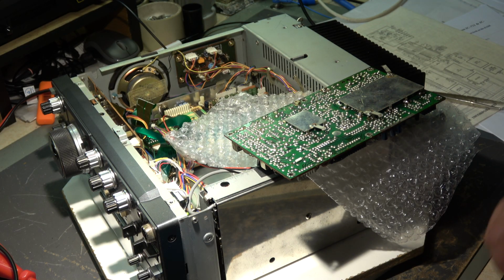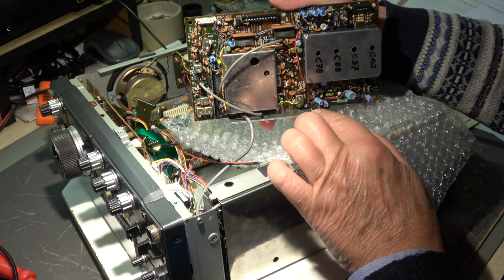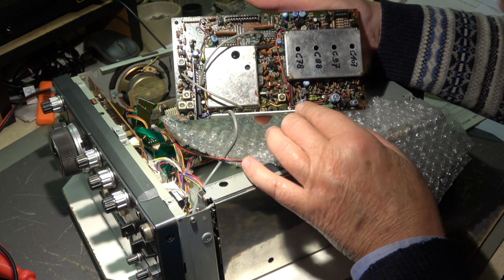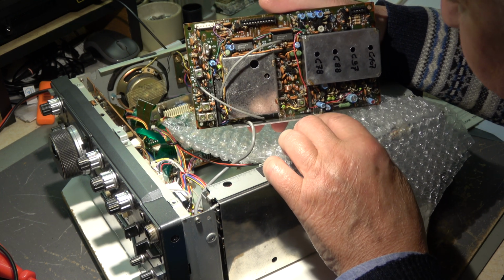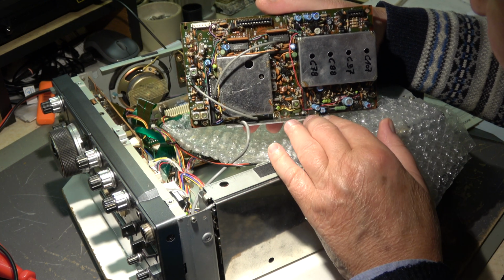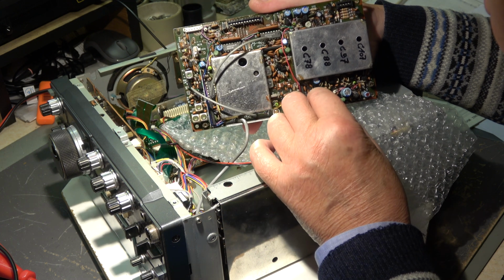The bottom shield is also in place again, soldered around. All pins are soldered. By the way, a small hint: whenever you see a semiconductor on a heatsink, retighten the screw and the nut. Over the years the screw may get loose, or the grease, there is no thermal grease as I see, but when there's a grease between, it can dry out, and it's a good idea to retighten these screws just to prevent any problems with overheating and so.